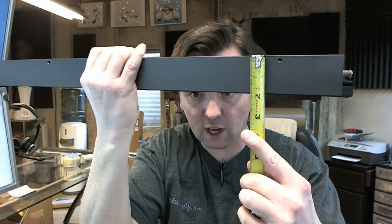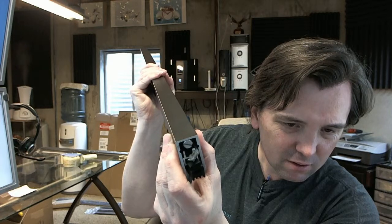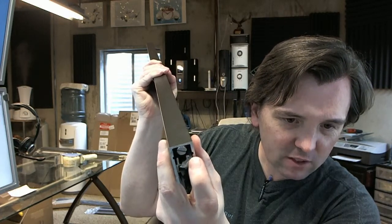And then 1 and 11/16 inches overall height of the extrusion. It's large because this is the heavy duty version, meaning it's packing a really large piece of neoprene inside of it. It's also packing a piece of pile that fits into the extrusion on the inside channel, effectively giving you a double seal — the neoprene is large, and there's the additional weatherstripping feature of pile on the inside that makes contact with the inside face of the extrusion.